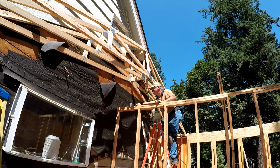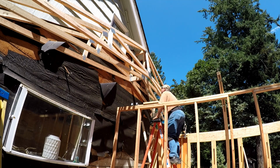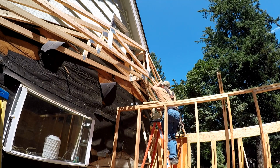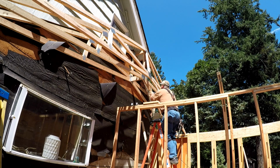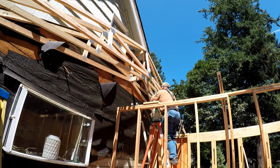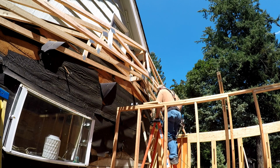The second truss is spaced out from that bathroom window there, and we will need to custom frame a little window trough up there so that there's a little ledge in front of the window, and we'll get a stainless steel pan to put in that trough area for rain protection, and then you would also be able to put flower pots or whatever out there, and the stainless steel will be very tough and waterproof, wear resistant.